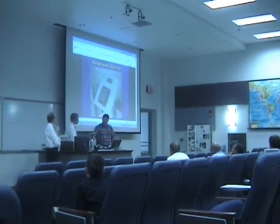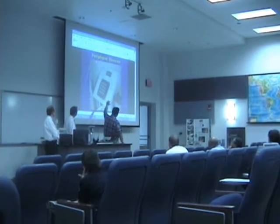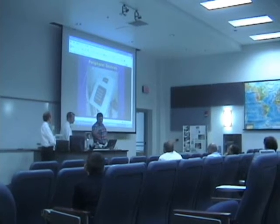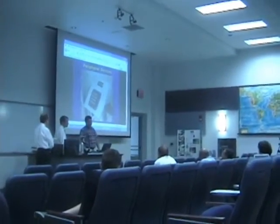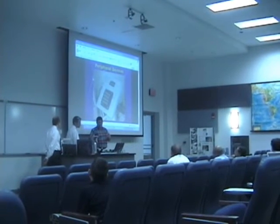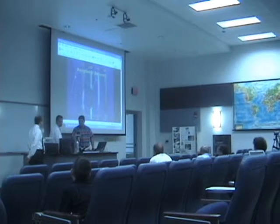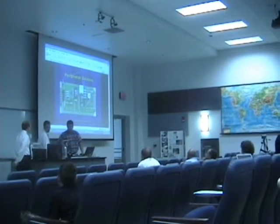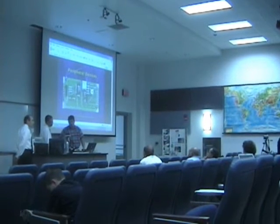Two of the devices attached are a keypad and an LCD. The keypad has 16 keys: 10 of them determine what hole is played on the harmonica — pressing the left-most key selects hole number one, moves the harmonica there, and plays a blow note. There's also a key for a draw note, a key to turn the backlight on and off, and four pre-programmed songs the user can select. To save IO lines — we only had 32 and almost all were used — we purchased an LCD controller that converts parallel LCD to a serial signal, so we use one IO line instead of twelve.